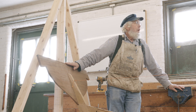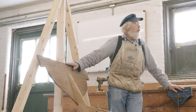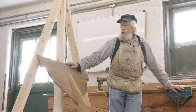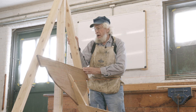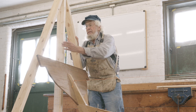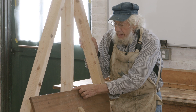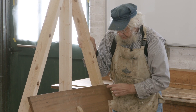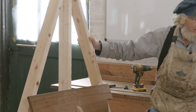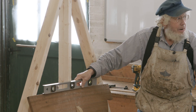You don't want to end up in the boat and find out that one side is a little bit longer than the other — you want that to be exactly correct. So we have set and braced this up here, and these braces are parallel. We'll bring our transom right up to that, line up the centerline on the centerline, and put a level on top. And that was level right there.